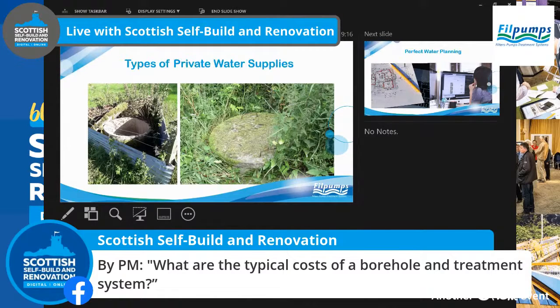Any water flowing through the soil and loose rock can collect in the well, providing a source of water to draw from. They are simple and quick to put in place, but they do have some drawbacks when it comes to reliability. First and foremost being that there is no actual consistency in the quantity and quality of the water supply. Anything that can affect the soil can affect the water. For instance, seasonal weather changes may mean in summer the soil dries and the water flows away rather than pooling in the well. Water can even be lost to evaporation. And in the winter, the ground freezes and can limit the flow of water. Any contaminants that can get into the soil, such as fertilizers and animal waste, can change the water quality.